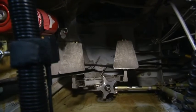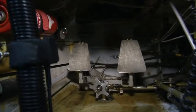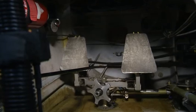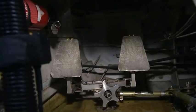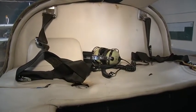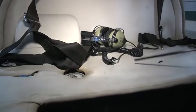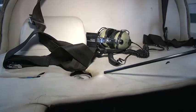In the air, the rudder pedals serve to provide yawing motion. Pressing the left rudder pedal moves the control surface towards the left. When the right rudder pedal goes forward, the rudder moves towards right and gives a yawing motion to the aircraft. Behind the pilot and co-pilot seat there is a fuel tank with a capacity of 91 litres, of which 85 litres is usable fuel and 6 litres is unusable.